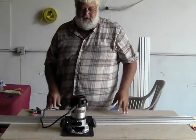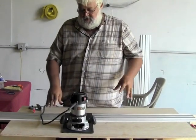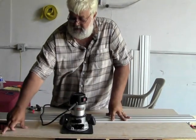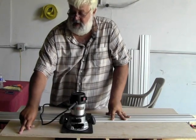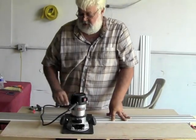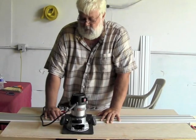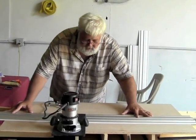What we're going to do now is show you the router plate in action. The track system coupled with the router does straight-line routing exceptionally well. If we wanted to cut a groove or a rabbit in the edge of this board to recess in a back, doing that freehand or with any other guide can be difficult. So we've kept the quarter-inch bit in there, and there are a couple of notches on the side that line you directly up with the router bit — taking the guesswork out of where the bit is.